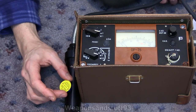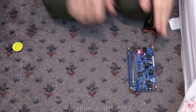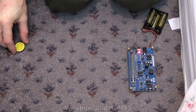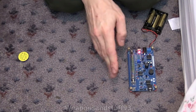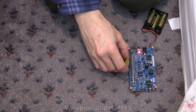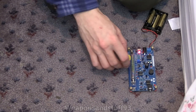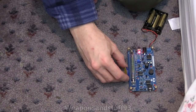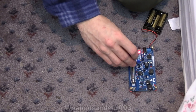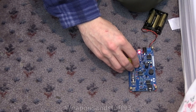Right now, just to show you what it looks like on a classic Geiger counter for those of you who want to hear a bit of ticking — DIY Geiger counter. It's not plugged into any Arduino stuff at the moment. Let's flick it on — you'll hear this ticking at least even without the screen, so you'll get an idea of the tube getting counts. Let's now turn it to face the tube. Bear in mind this will be picking up beta and gamma because there's no shielding between the tube and the air.